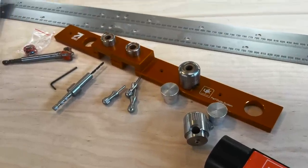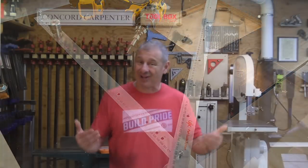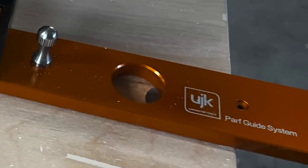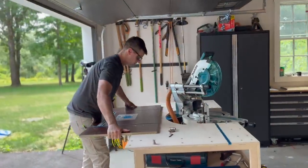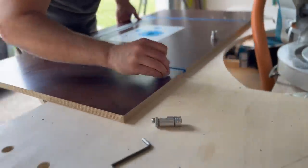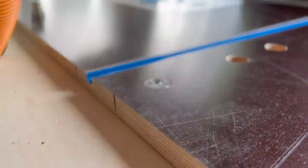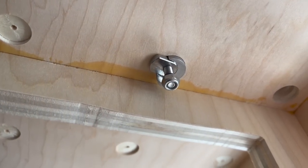Now, mounting the router table to the woodworking tables — they mate with the 20-millimeter holes cut in the same pattern using the PARF guide system mentioned earlier. With the holes lined up, a pair of TSO PowerLock bench connector dogs can be securely mounted to cantilever our router table right off the bench. The PowerLock bench connectors are designed to insert into a pair of overlapping three-quarter-inch thick material 20-millimeter holes, and a locking lug at the bottom flips out and can be tightened with a five-millimeter wrench.